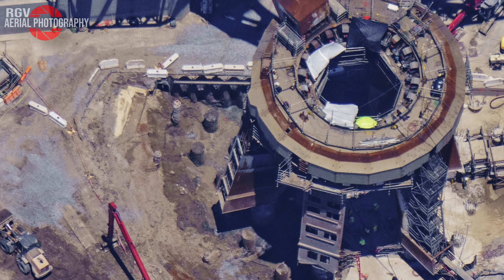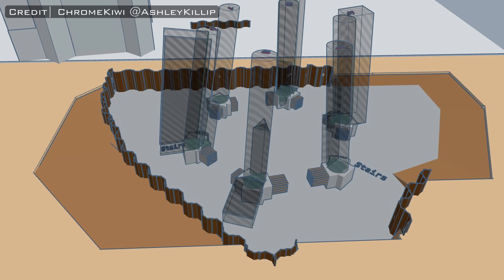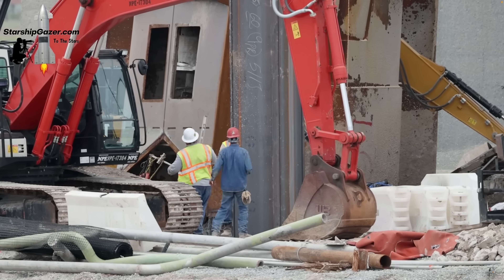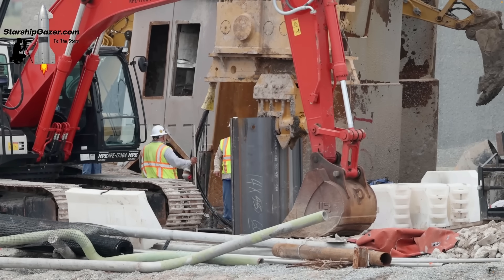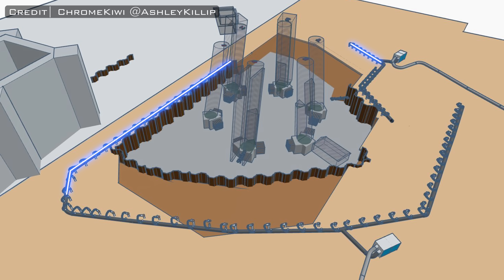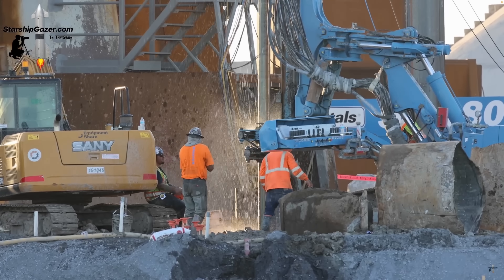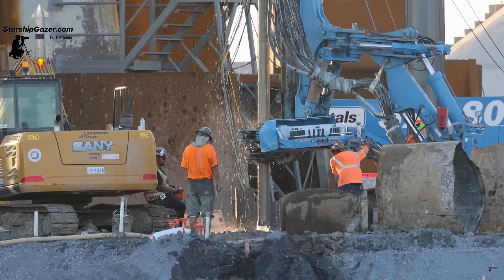The first was to create a watertight perimeter around the entire foundation of the launch mount. This was accomplished by installing walls of sheet pilings into the ground to enclose most of the area. Sheet pilings are long, corrugated steel panels which are designed to interlock with each other. This helps to keep the water-saturated perimeter walls from collapsing into the excavated area, but it's not enough to prevent groundwater from rising to the surface. For this, a dewatering system was installed along the perimeter of the barrier wall several weeks before the excavation work would take place. This type of dewatering system is known as a well-point system. The hollow pipe is drilled about 6 meters into the ground using a small drilling rig.